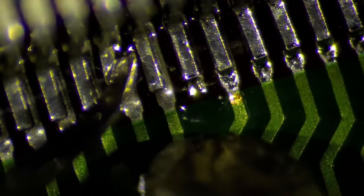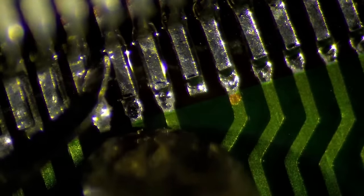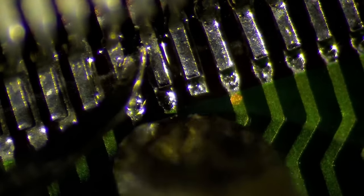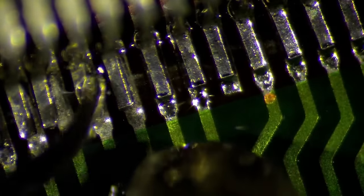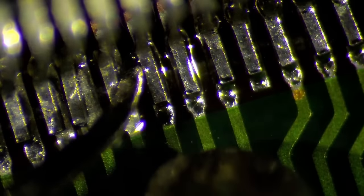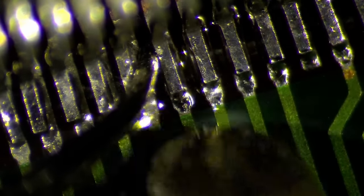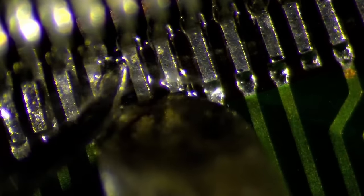Sometimes it's just random, like when the card, for instance, is cold, you have problems. So let's say you start a game when you power on your PC in the morning and the card is still cold and it doesn't work. Just with time, while the PC inside slowly warms up, the card starts to work, and it may be one of these solder joints that cause that issue.